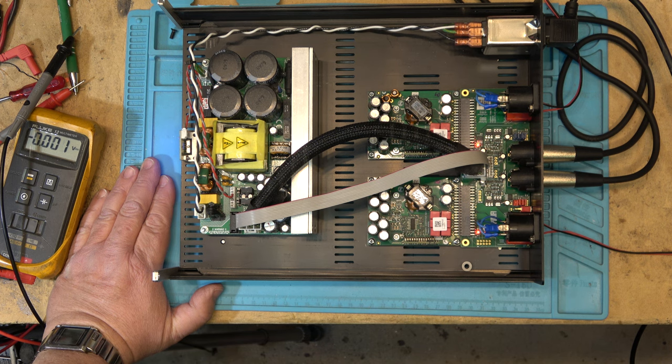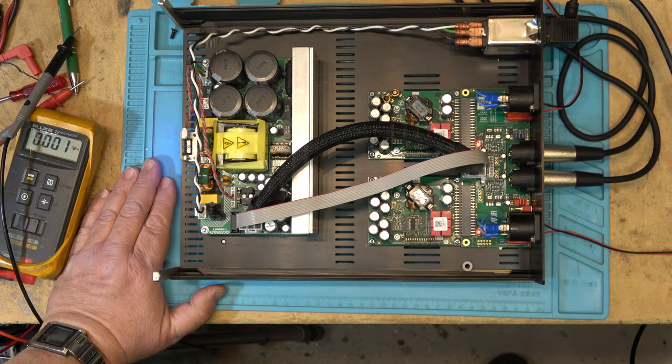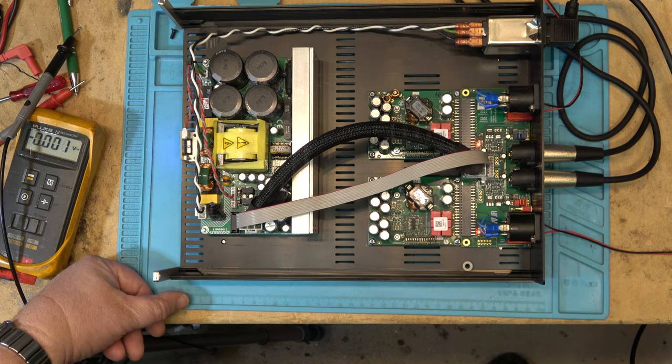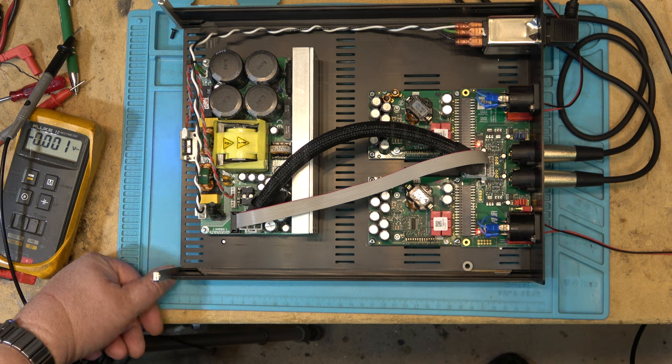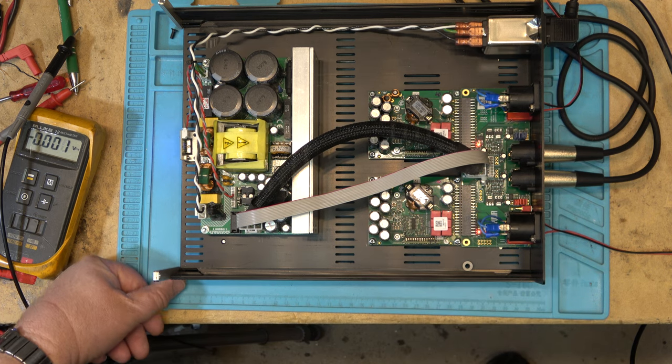And to the purists out there that see it's creating a square wave, well, it's creating a square wave as a switching signal, but that is canceled out. That's completely removed. It's not part of the audio signal. It's so far up in the spectrum that subharmonics from it would still be well beyond the hearing range and well beyond the range of any tweeters or any type of audio reproduction equipment. Most of the new ones are running up around a megahertz or so in frequency, and there's no speakers that are going to produce frequencies up to a megahertz. Even subharmonics is still going to be so far removed from the audio spectrum that it's not even worth mentioning. The distortion on these is below the measurable limits.